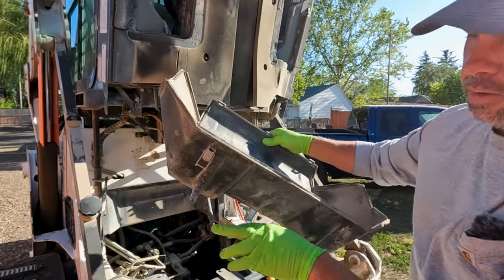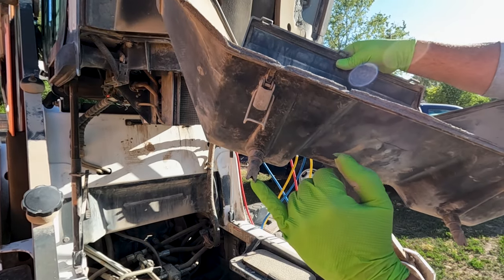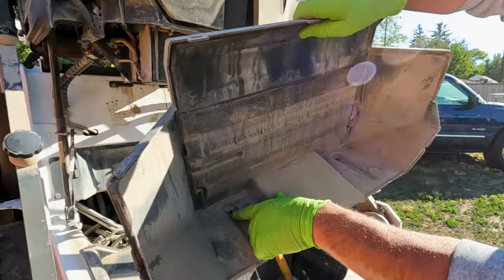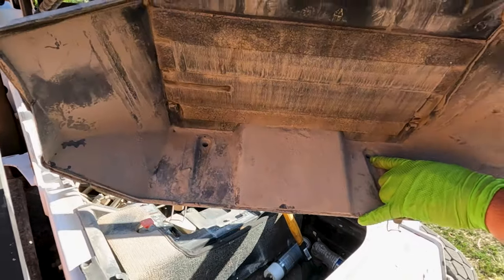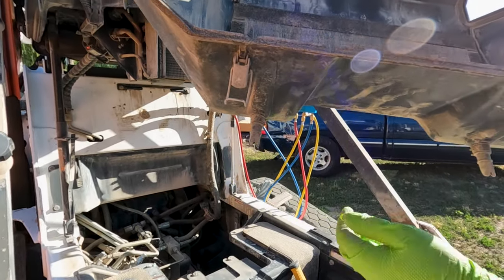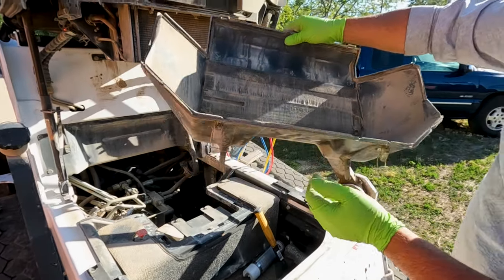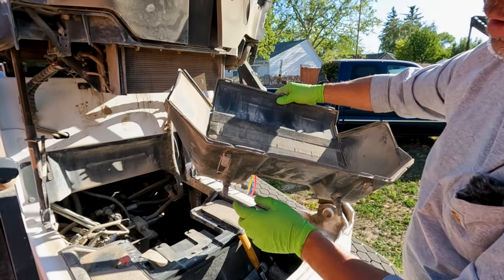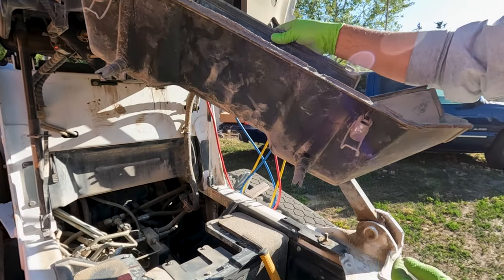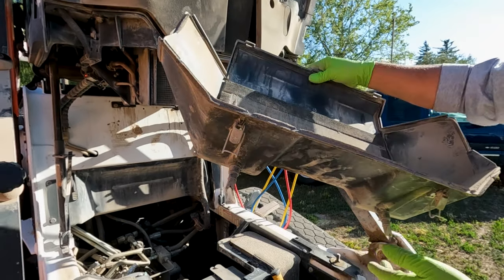Now on the bottom of this cover, you can see these little duck bill drain valves. This one has a notch cut out of it. Usually they don't have a notch cut out of it — water is supposed to drain through the holes here in the cover. If dirt gets down in this little duck bill, the water cannot drain out and it'll just cause mud to build up in here. Water will actually build up in here and freeze inside our coils. That's why these are cut out — usually cut like a V or at an angle so that water can drain out. That's probably one of the biggest problems with this system: these get clogged up so easily.